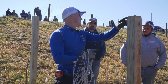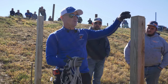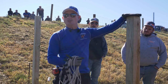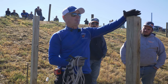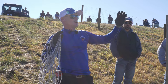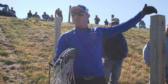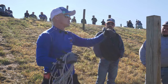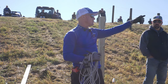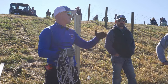We used to just beat the top of the post like everyone else, and you worry about splintering and smashing the top. With 4x4s you can really do damage. So we have a protector plate that goes on top called a Protector, and then we have a sledgehammer made so the head is up and the handles are down — when you hit, it's flat. You don't want to hit with the edge of the sledgehammer because the energy gets absorbed. Hit flat on top to get the most impact.